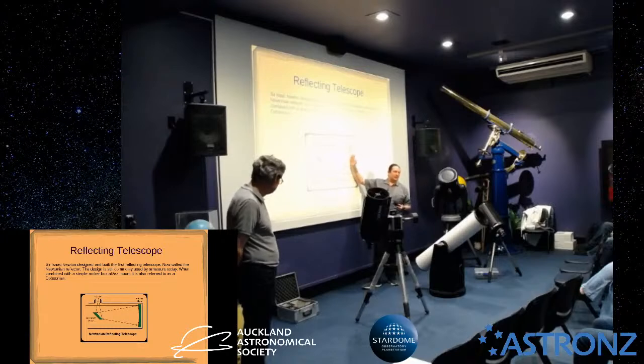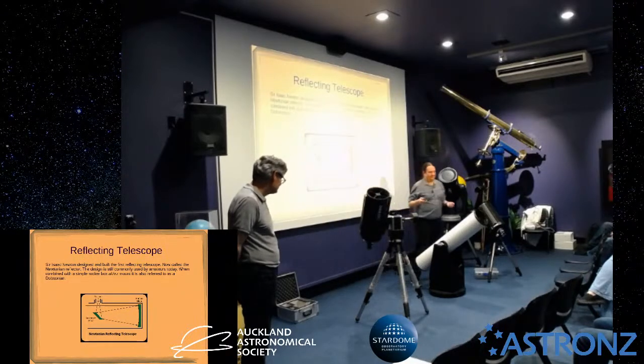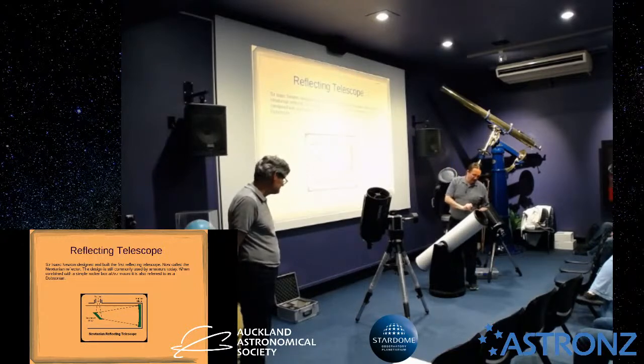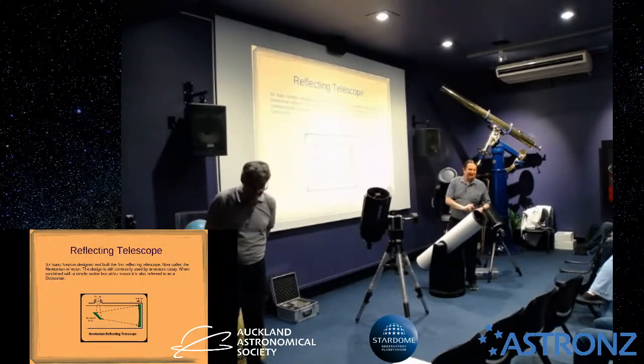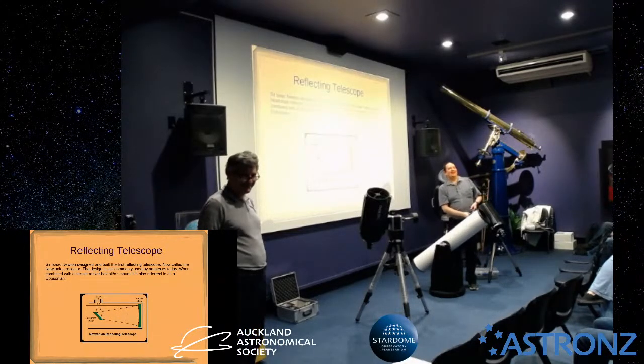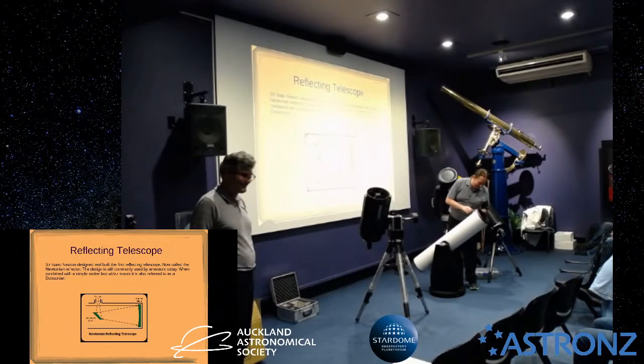The primary mirror on most telescopes of this type has a mark in the centre, a circle or a dot. The light should reflect all the way back and hit pretty much exactly the same spot on the secondary, and then come directly into the same hole on the laser. The laser has a screen, so you can see. Now, I don't know how well collimated this one is. I did it about an hour and a half ago. Okay, we'll see how well you did that. We'll see how good it is, or consequently, how off my laser collimator is. Otherwise, it failed.